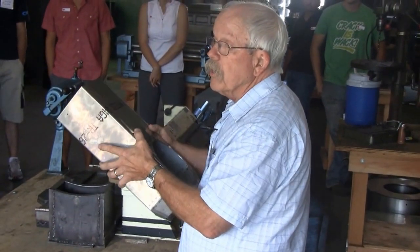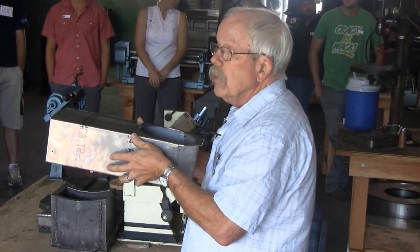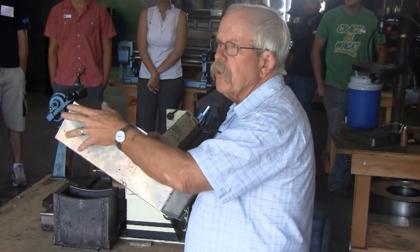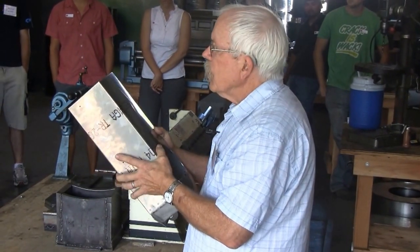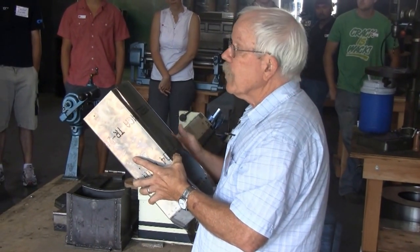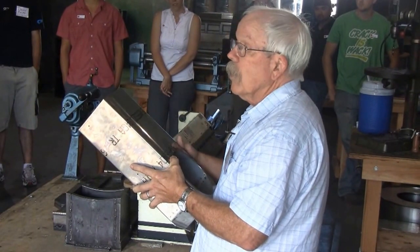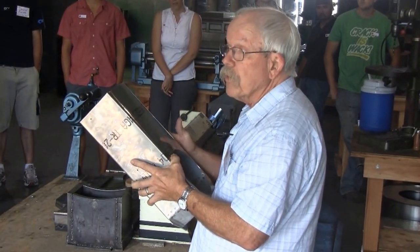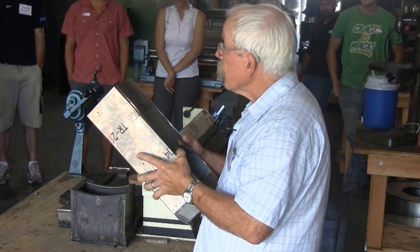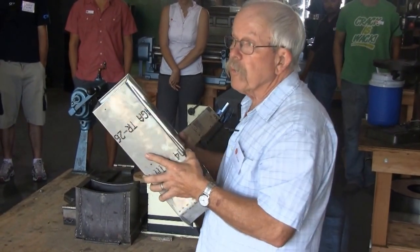What we're doing now is changing this metal from 310 stainless to 601 stainless. In our 100-liter stove, it's a one-inch bigger combustion chamber, but the firepower is hugely increased. We're running the pasteurizer for 10-hour stretches and generating more heat than the 310 can tolerate. So we're going to the 601, which rates another 100 degrees and should be fine for even the heavy use of running a pasteurizer.